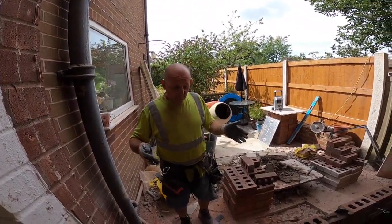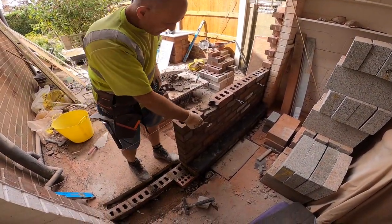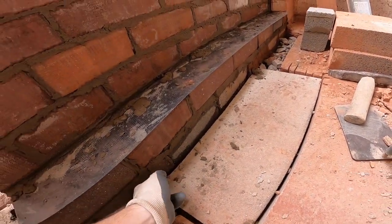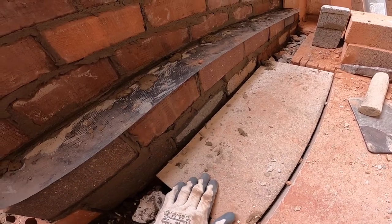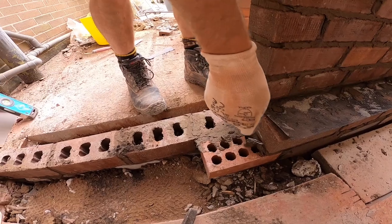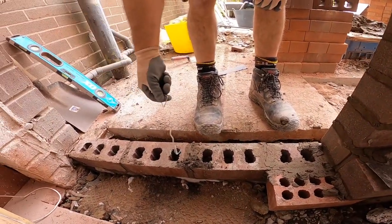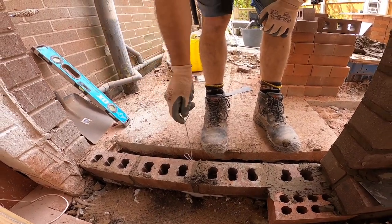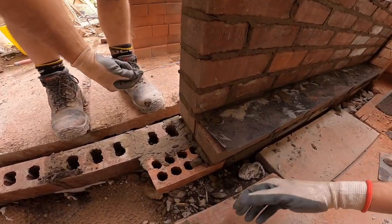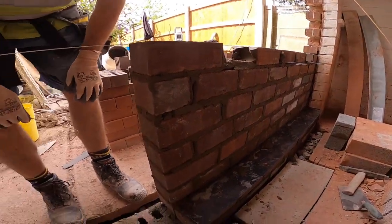Right, we've started. Brickwork has started. Lintels are in, flag's cut on the back. It's not bedded yet, it's just temporary so we can move it. That red brick there needs cutting back. It's cutting out so we can patch this floor up to the door. That's damp course level at this end, because there is no damp course. But it does need a damp under a plastic door, so we've raised our damp course level at this end so it's a bit higher off the floor. Like I say, there's no damp course in the garage, so at least our bit's got it in.